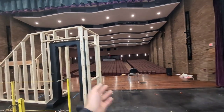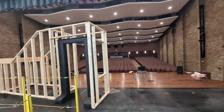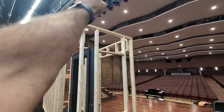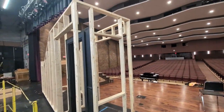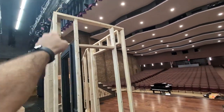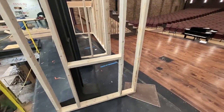So now if I pull them out of there and make that set piece, I could basically put the pieces that came, I could make another little short wall component to the top and put him on there and clad it all with luan like we were going to anyway. And you'd never know. But I have to do some blocking between the one and the other to keep it perfectly straight. It turns into a whole scenario, which sucks. Maybe that's what I'll do.